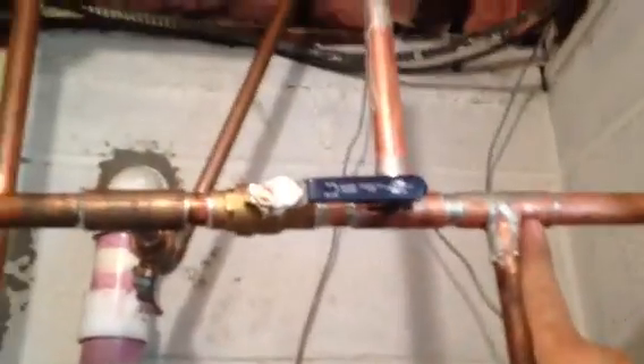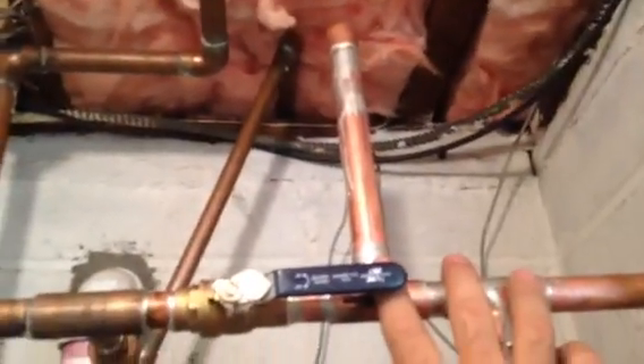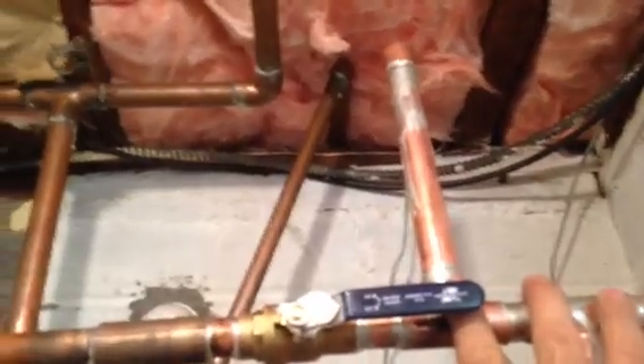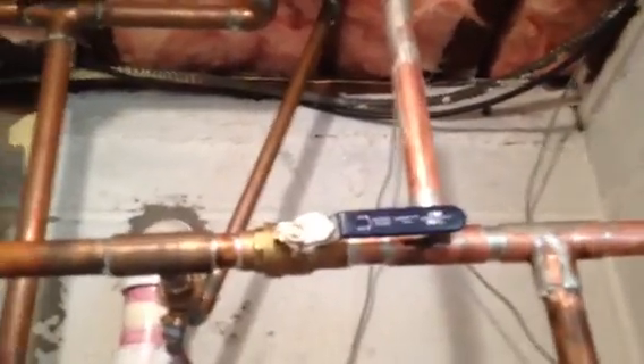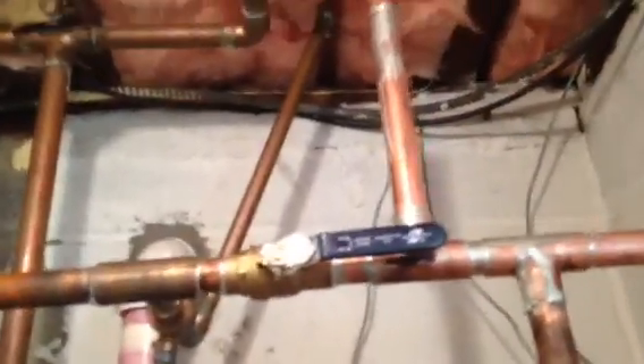Redid the fittings here. This is eight inches of three-quarter inch pipe with a cap up top that I put in as an additional homemade water arrester. If that doesn't really work, I'll go ahead and unsweat that and put an actual water arrester in there.